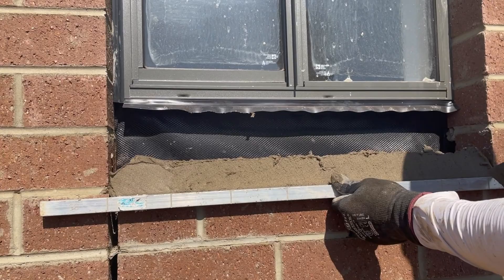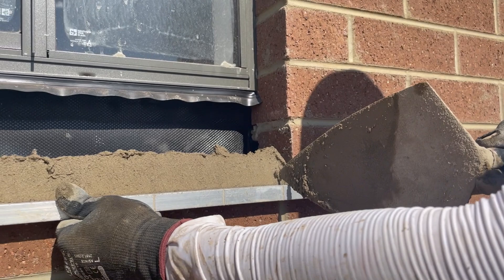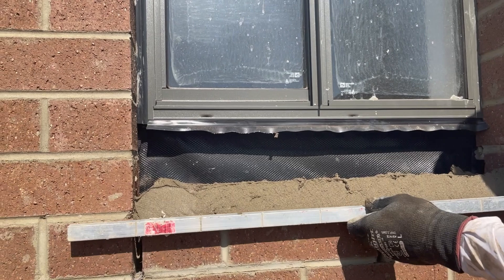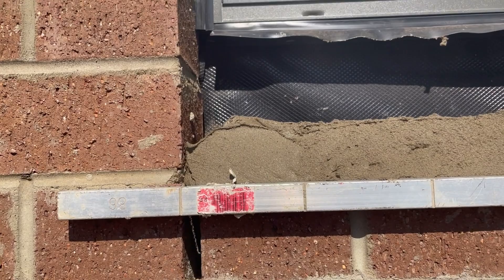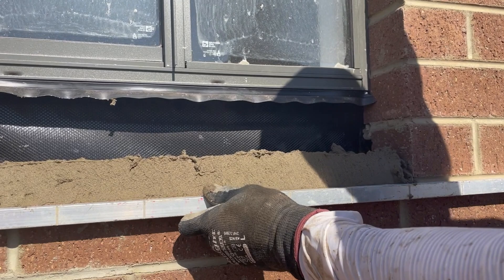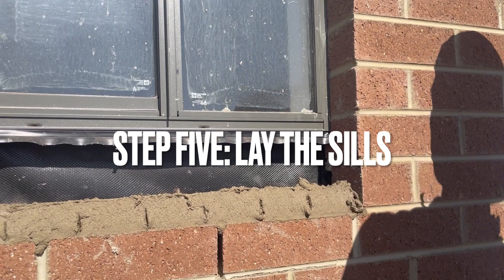As you can see on this side I have quite a big gap — about 20mm. So I need to change the gauge from 86 to 87, because that's a bigger joint. Now lining it up with the brick again on the left side, as you can see on the right side the gap has closed because the joints are bigger. I'll go with that, then mark the remaining positions with the gauge rod, and here are my marks to go off.